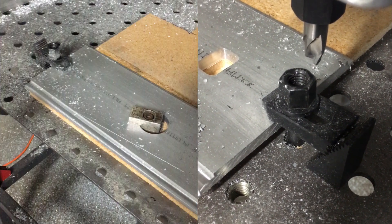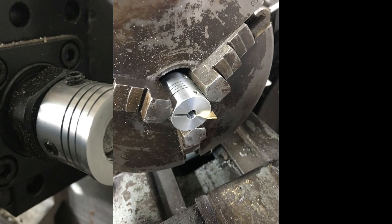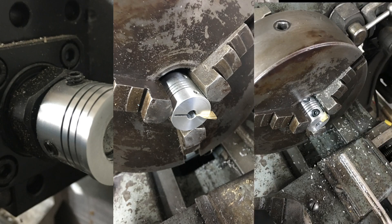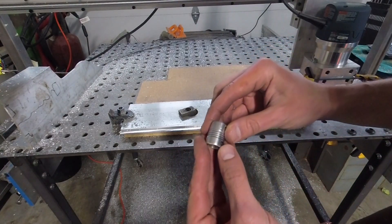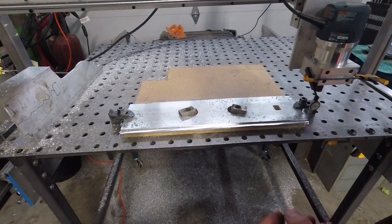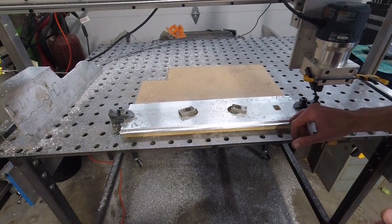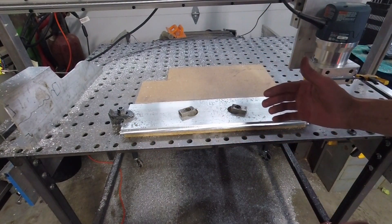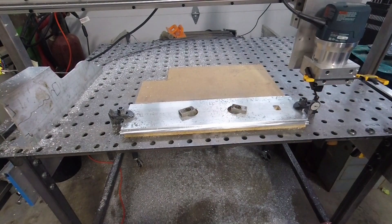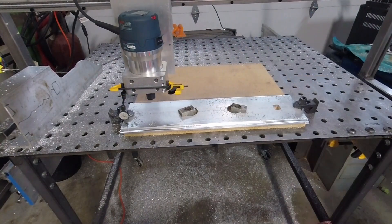Wasn't paying attention when I was moving out and crashed my clamp. The result was a broken coupling — luckily I had a new one but it was the wrong diameter, so I drilled it out and reamed it to fit the servo. The flex coupling for the Y-right axis broke, so I needed to re-tram the machine. Thankfully I had this machined surface to work off of so I could get it back to the same tram as when I started. Another quick tram — I was just spinning the ball screw with my hand and it was working out well.